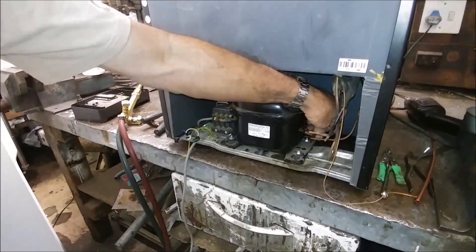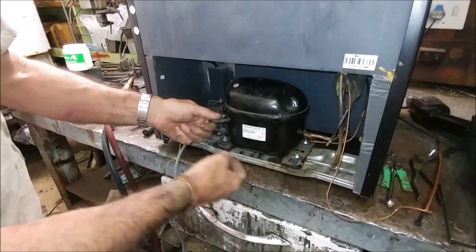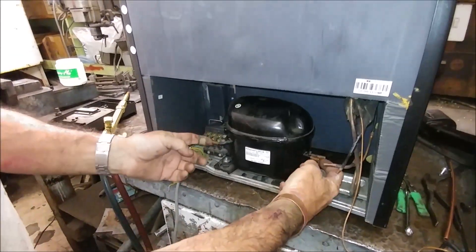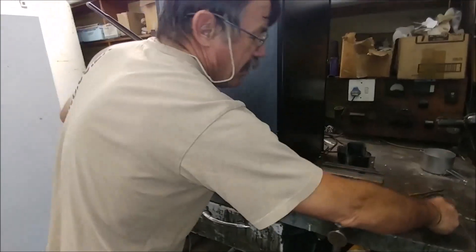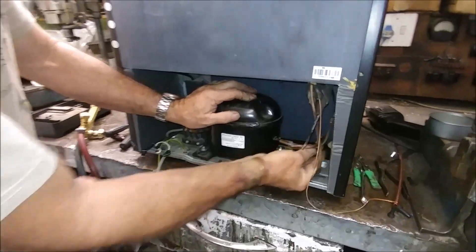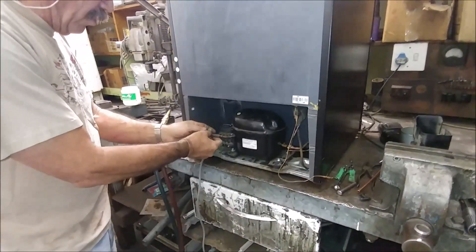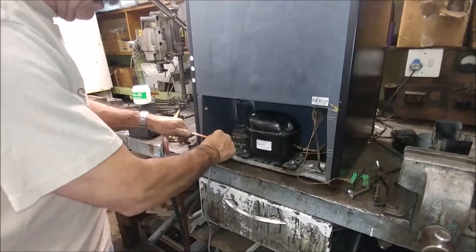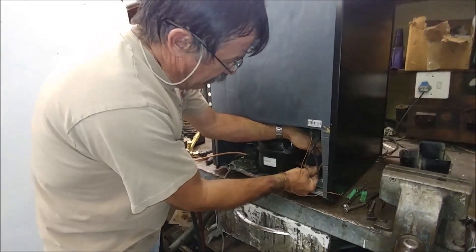When you pull these rubber plugs out, first pull the one out on the high side — the smaller tube — before you pull the suction out, because if you pull the suction out first sometimes it sprays a bit of oil. The tube going in here is quarter-inch but sometimes they're a bit tight, so we just swage the pipes. I use these little swages just to check — this is supposed to be quarter-inch and it fits in nicely, and this one is the 3/16ths which we can't really get in there. This is the other quarter-inch side — we make sure that goes in, otherwise the tube doesn't fit. So we stick the copper tube inside there, same with that one and same with this one.